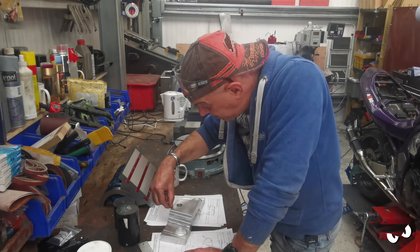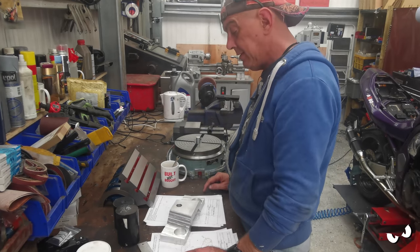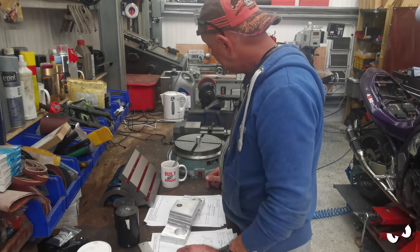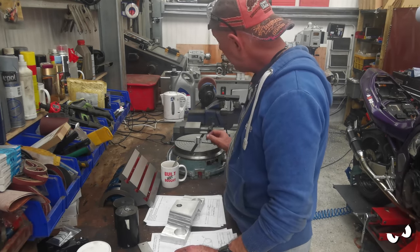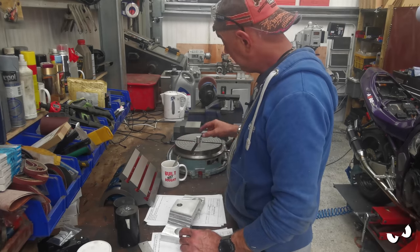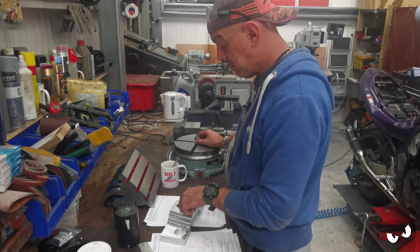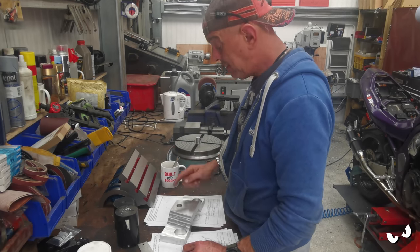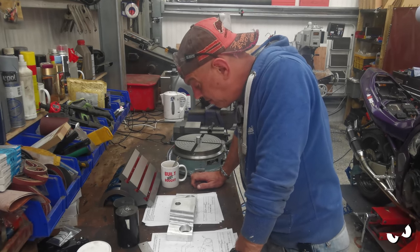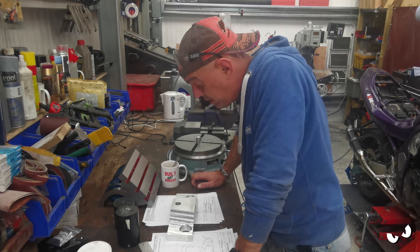So essentially we're going to be coming along there, taking off this shoulder, getting wider, and then sort of straight along there. And I'll be able to use exactly the same peg, because I could put a hole that size through that peg that goes in there. So I could centralise it on the rotary table just to do my radius round here. And I've got that peg which goes in this hole anyway, so I could centralise it to do that radius there. So I reckon that's how I'm going to do it. I can't think of a better way. In fact, I can't really think of another way.